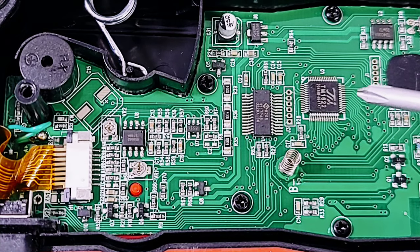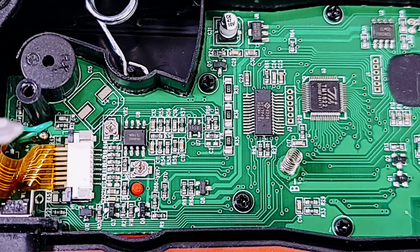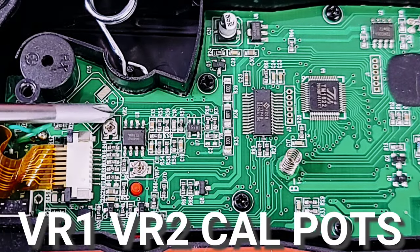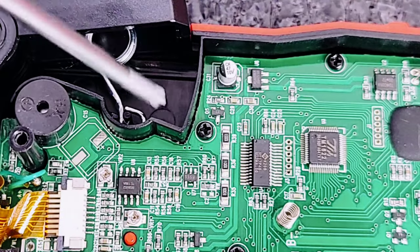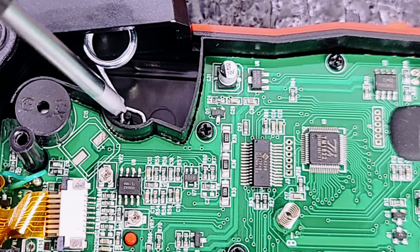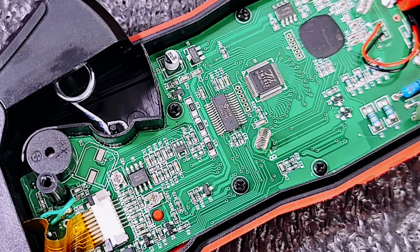The main LCD display driver is the TM1622 from Shenzhen Titan Micro. There's an op-amp — the GS8552 — a transamp with an RF filter, which is amplifying the signals from the current jaw. We also have two trim pots, VR1 and VR2, so apparently you can adjust your voltage. At the top there's a linear voltage regulator, and the trigger has a steel spring plus a little plastic mechanism — I think that should be okay in the long run. Super clean board overall — would have liked a little more solder on those input jacks, but that's pretty well it.